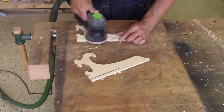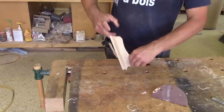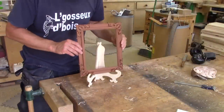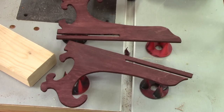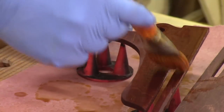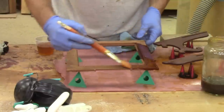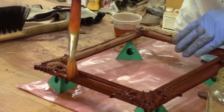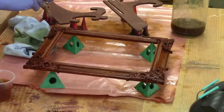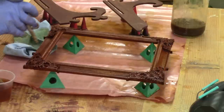But I still need to do a bit more work. Here's my stand — this will be perfect for the picture frame. But it's a little bit too light. I need to stain the wood. After spreading the stain everywhere, I need to wait for it to dry. When it is, it's time to brush some shellac on both pieces and also on the picture frame. I use a brush to apply shellac on all the small holes on the frame. But still, it's a bit too much — I have to blow the excess away. I brush five coats like this.